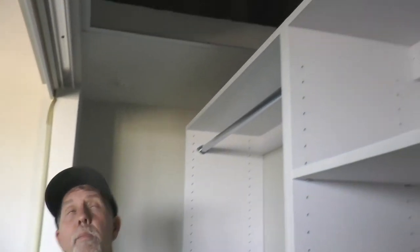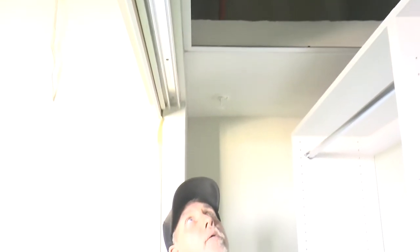We're here to overview the exhaust fans for the 8th through 30th floor toilets. The system has a main central duct that tees into every individual apartment toilet. At the end of the west building, there is an inline exhaust fan that runs 24 hours a day exhausting all toilet exhaust gases. Based on the sound, it's a direct drive, 120V unit. There's no maintenance required on the motor as it's self-sealed — no greasing, no adjustments. Each individual floor has its own separate fan and power source; there is no centralized control.